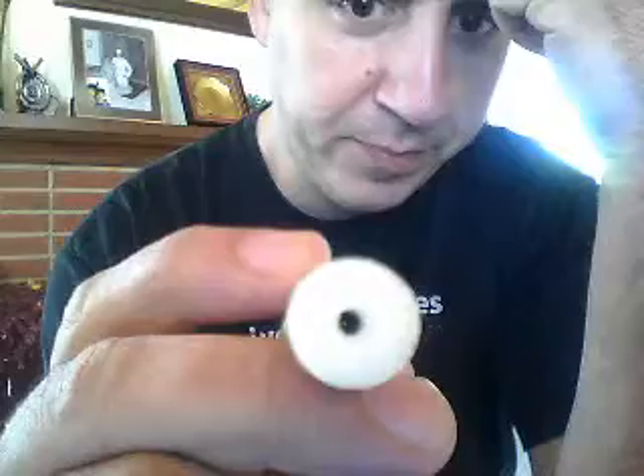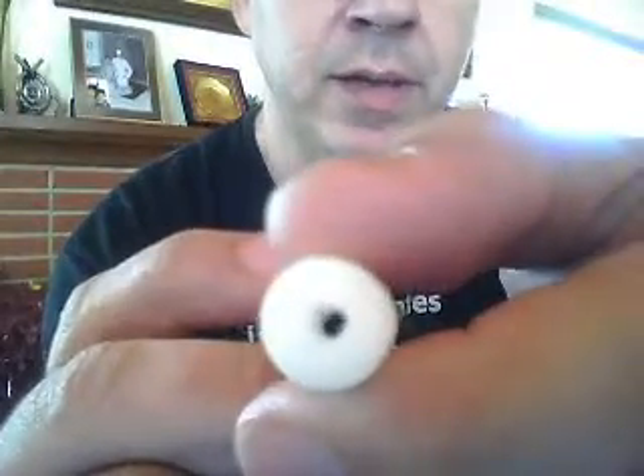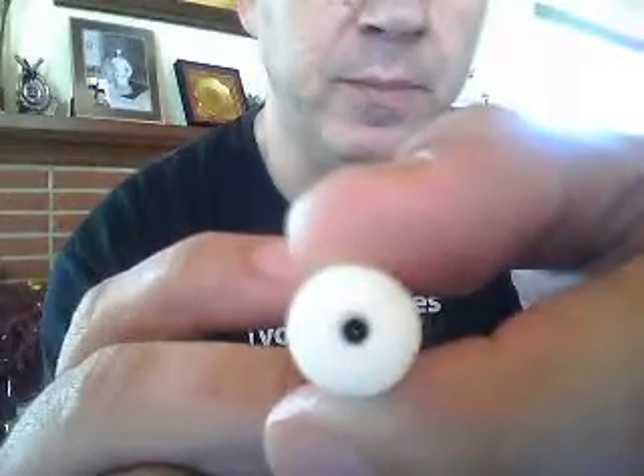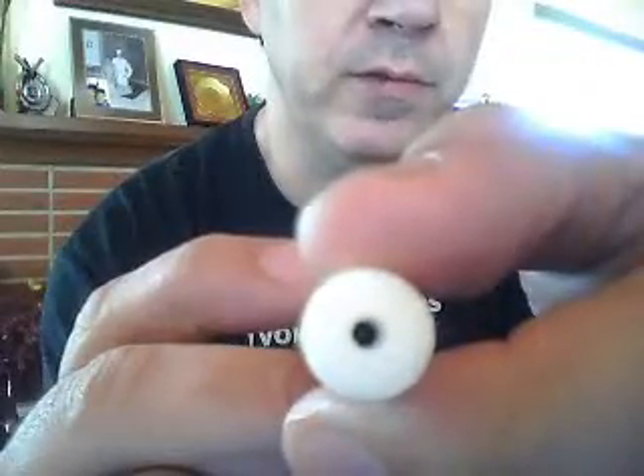You can find other videos where I've tapered that down, but basically the hole is 4mm — a lot bigger than the filament that travels down through there, and that reduces the contact between the filament and the PTFE rod as it becomes warmer further down in the tube.